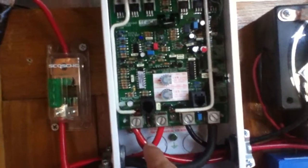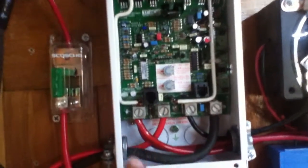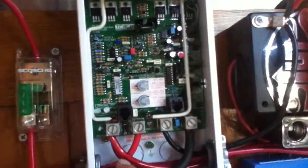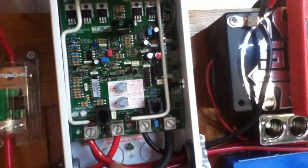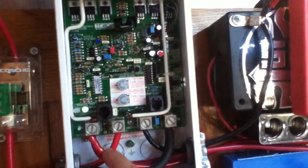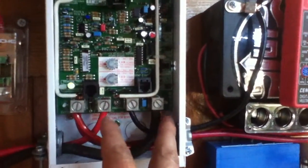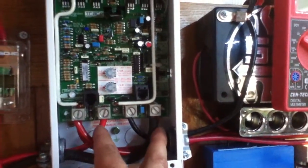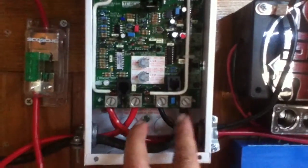Basically on this, I've color-coded it: red is positive, black is negative. Your two battery cables and load — because there are no separate connections for loads — the batteries and load both go on these terminals. There's enough room in there to get a couple of extra cables in. I put the load positive over to this little load center, but the battery side are these two right here. From the panels or wind input, that's going to be on this side.